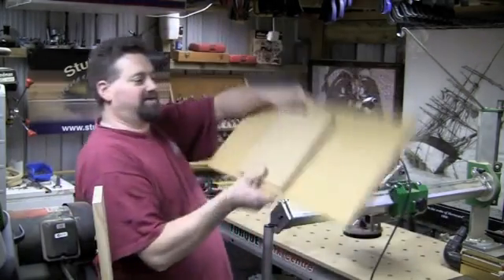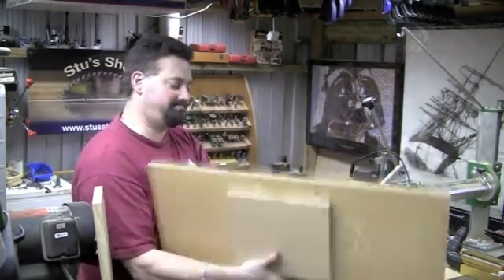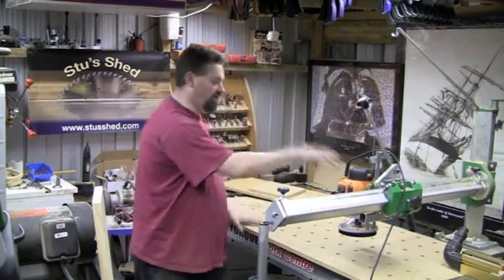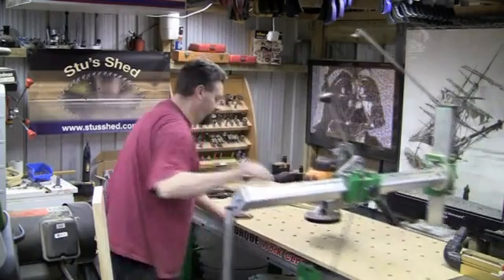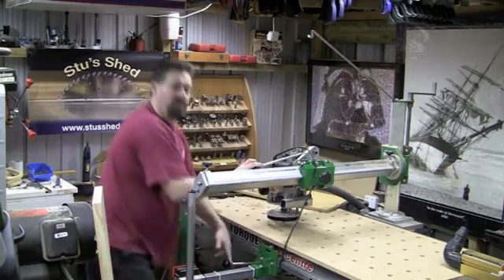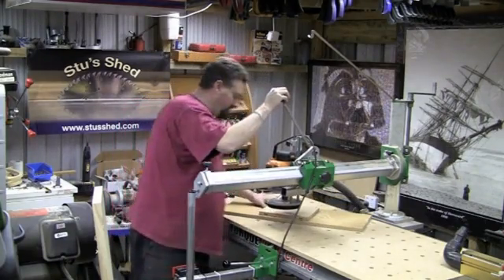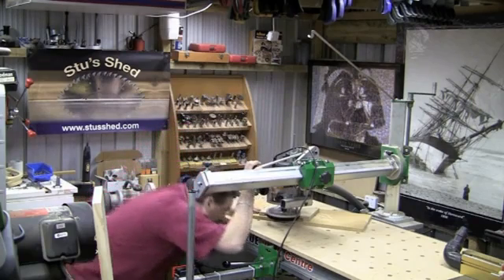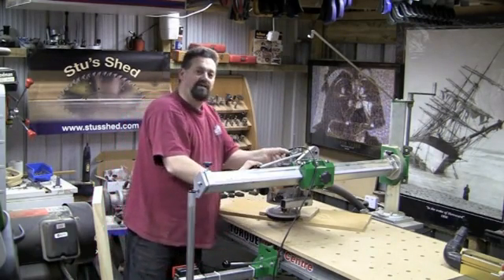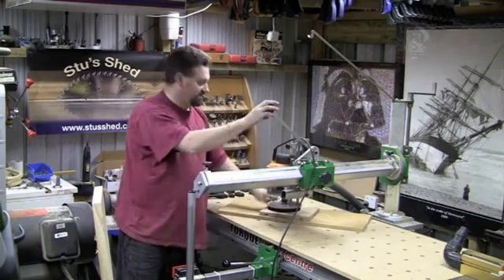In this case I'm not doing that — I've actually just physically screwed a piece of board, which is what I'm going to cut it out of, screwed to the other side. The next step is to actually, once again, line the router directly above the pin there. I'll just plunge it down, get it nicely lined up, lock that axis, lock this axis, which I've already done. Then I'll bring the board in and plunge down again, and I'll just check to make sure that the router bit is actually plunging just through the workpiece into the top of the pattern, and then I set my plunge lock there. That way there's no point going too deep, but I know how deep I need to go to cut right through the pattern.